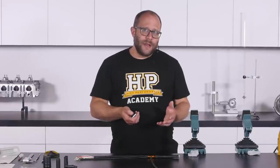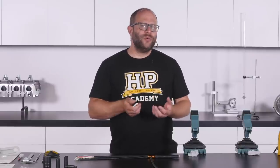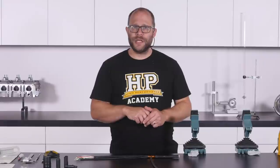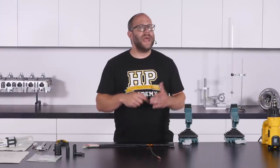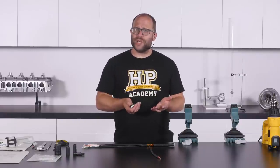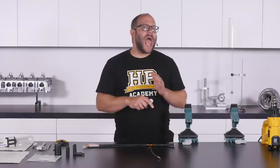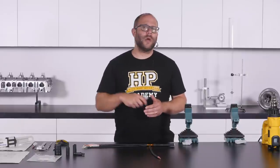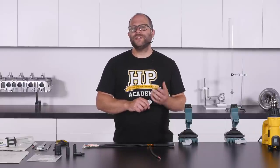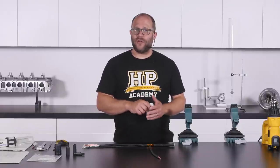There are boots available with a pre-applied glue lining which flows when recovered and seals the boot into place. This won't always be the case, and often you will need to apply a separate sealing epoxy compound. Three common compounds are Raychem S1125, Hellermann Titan V9500 — which we're using today — and Resintech RT-125. They are completely interchangeable and will all form a strong sealed bond between the molded boot shape and the abraded portions of our DR-25 sheathing.